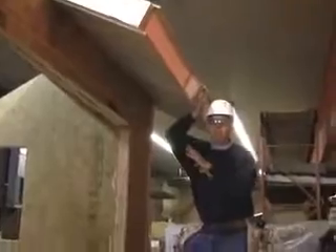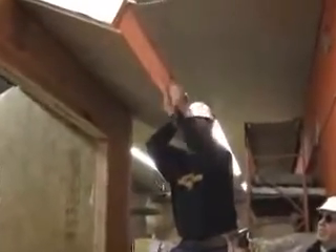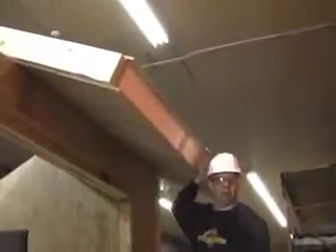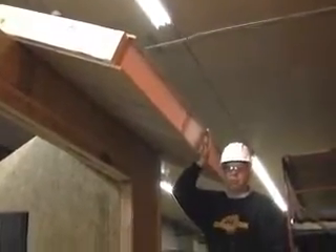So what we'll typically do is put two or three screws on the first panel, make sure it's secure, then bring the second panel into it. Now we have a longer run of the ridge line to verify with the ridge beam, and now we know we're running straight.